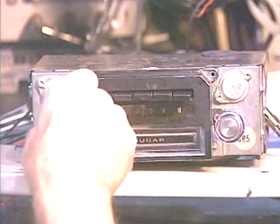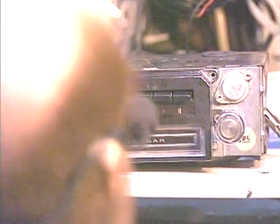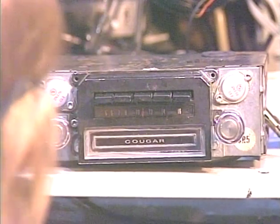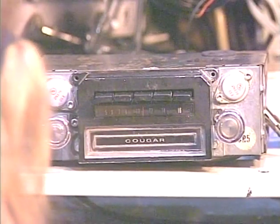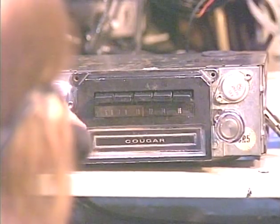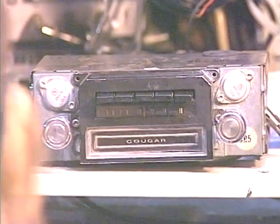come back, or he can turn it off and then turn it right back on, and the radio comes back that way. So that's the only thing that I'm not willing to do to this board that's already been possibly damaged by the previous shop by not providing enough heat dissipation. Unless the customer is willing to pay for a new module, he'll just have to live with the fact that the 8-Track will start playing immediately, but the radio will take 20 seconds to come back on.